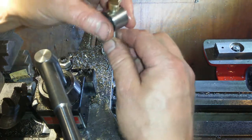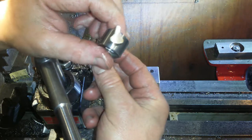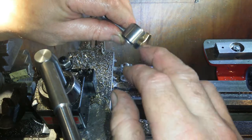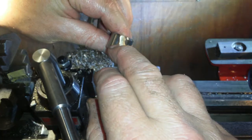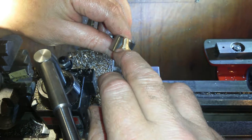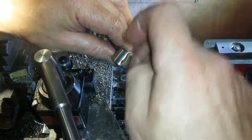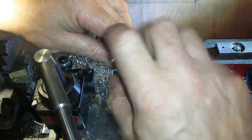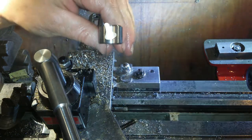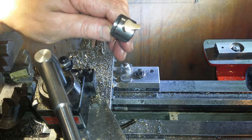So because there's plenty of material on the lever, what I think I'm going to do possibly is mill the shank off. That's painful. Mill the shank off, put a flat on it, drill and tap it, and put a longer lever on it. Then I can really put some leverage on it and lock it in, because it just isn't quite long enough at 16 millimeters.